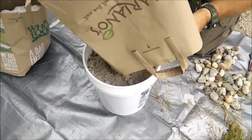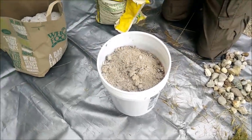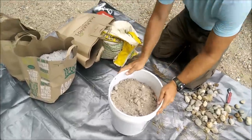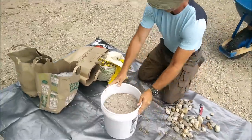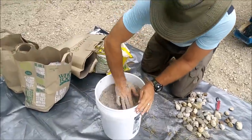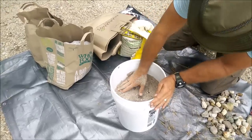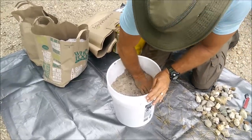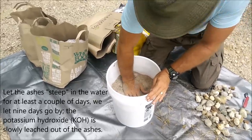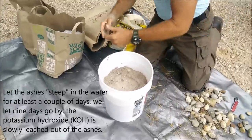We're going to have to start putting the water in as we go. What you do is, when we get this filled, you're supposed to be tamping this down. So you're compressing as you go. And then you create a little impression in the top, and you fill that with water, and then you let that water seep in. Then add a little bit more.